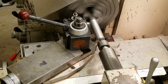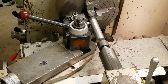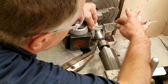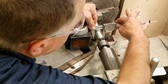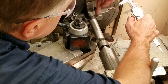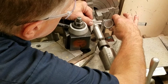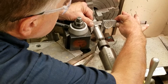I'll stop it here — remember when we measure, we always want to measure coming from the tailstock side. We just took about 65 thousandths off. We're at 1.185, so we need 50 to 60 thousandths to go. We'll take another 60 off of it and then get it to length. Don't be measuring this way — it's going to really mess you up. Lay your arm on the tailstock, bring your jaws in, and you can move them to find the smallest dimension. The smallest dimension is the actual dimension.